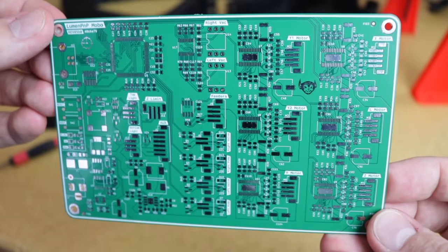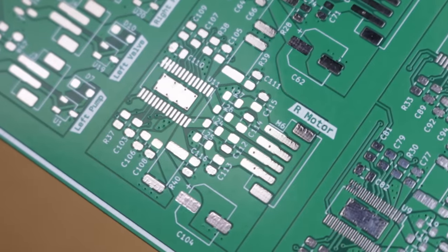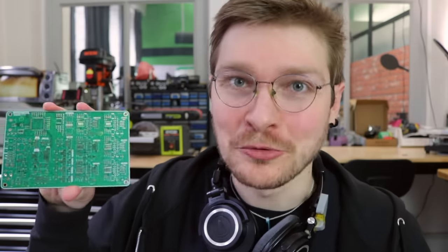All of this stuff leads to a new motherboard. I have already designed it — at least the first beta pass of it. This board is almost electrically identical to the previous version; it's doing effectively the same thing. I changed a little thing with USB power, and you'll notice there are fully integrated stepper motor drivers now — no more of those modules. They're fully baked into the board. And of course, nearly no through-hole — I think there are literally like 10 pins that need to be manually soldered. The rest is all machine assemblable, soup to nuts.